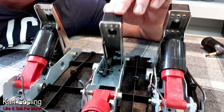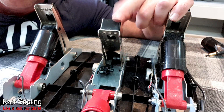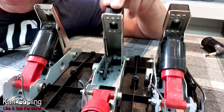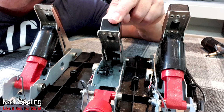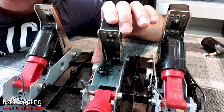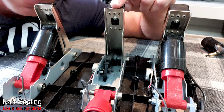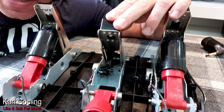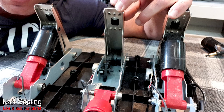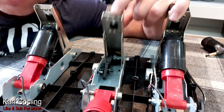This is the key difference between potentiometers and load cells. Potentiometers literally just measure the movement of the pedal — where it is, not how hard you press it. This potentiometer does not care how hard I press this pedal down — it doesn't affect the way it performs, it doesn't alter the voltage based on that, or the speed. All it does is a certain voltage all the way up, a certain voltage all the way down, and every little position in between the voltage is varied ever so slightly. That is how the game or whatever software you're using knows where this pedal is.